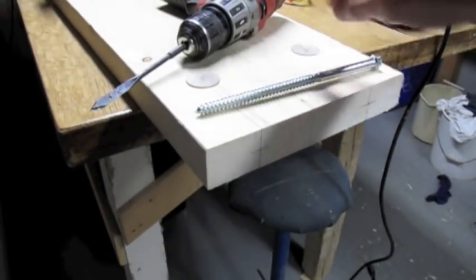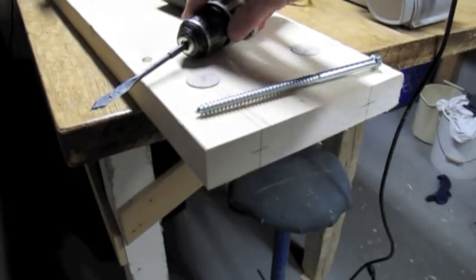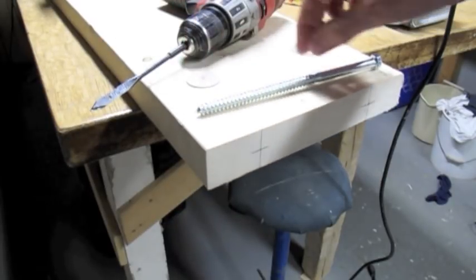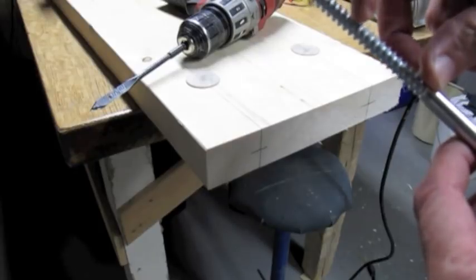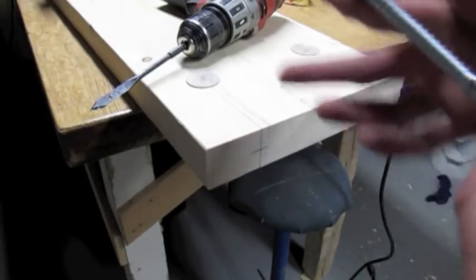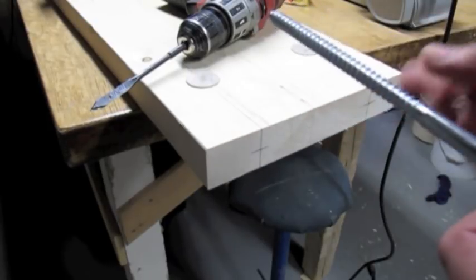Leave them sticking out just a little bit for sanding and let that dry. Now these dowels are dry and we're going to drill some holes. We've marked the end of the wood and we're going to drill a 5/16ths hole right through the center of the dowel, just to the other side of it. We come to that size because that's the inner diameter of the bolt shaft — the outside of the thread is 3/8ths, so the inside is 5/16ths, giving the threads a hole to bite into.